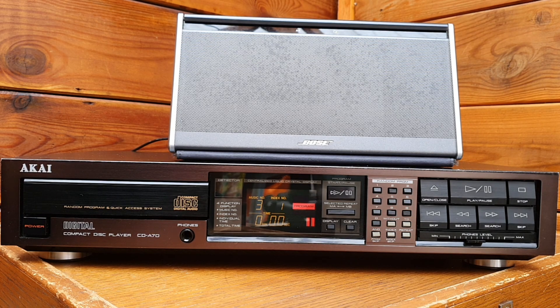This Akai — they have used their own DAC chip. They did not use the Philips TDA, the famous one, but they used a DAC chip produced by Sony — not by Akai themselves, but the Sony CX20152. And they have used a very good mechanism: the CD mechanism, which is KS121.